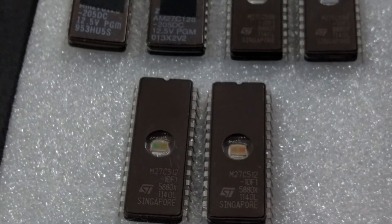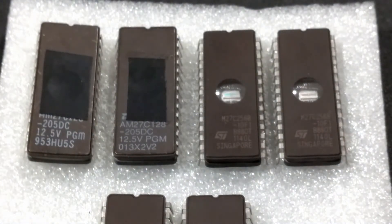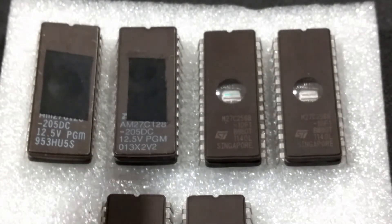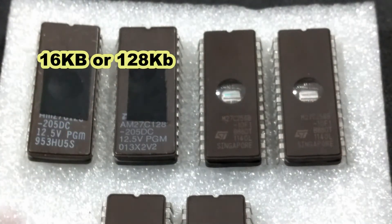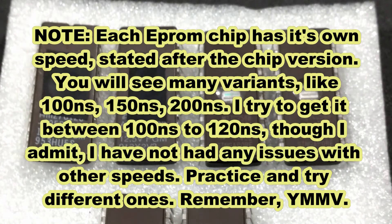For the most part, you're going to be focusing on and using the top two chip types. Because N-ROM games are either N-ROM 128 or N-ROM 256 — they don't use 64 kilobytes, at least from what I've seen. There might be one weird one out there, but for the most part these are the ones you're going to use. The 128 is 16 kilobytes, and the 256 is 32 kilobytes. It depends on the game — you can use either one for CHR or PRG.